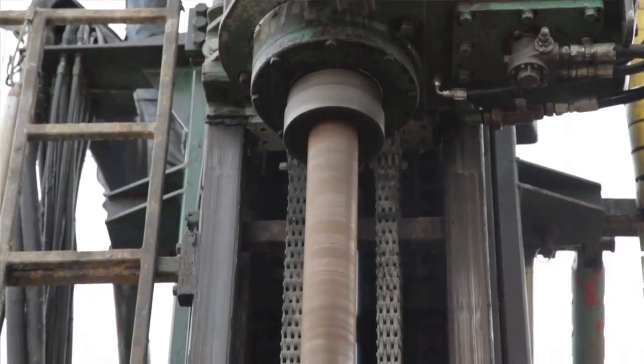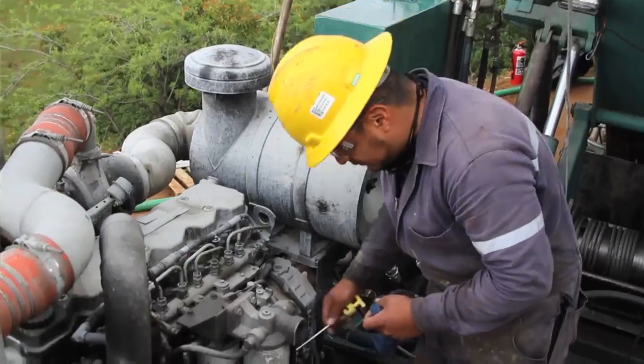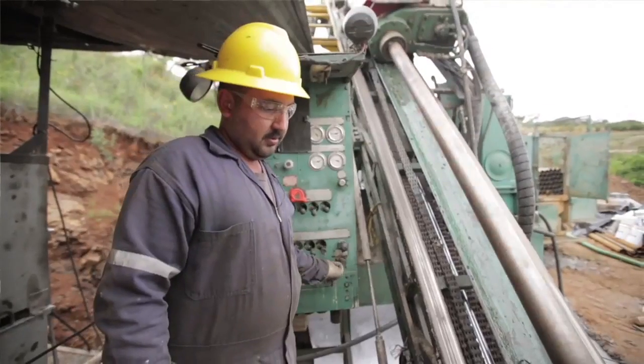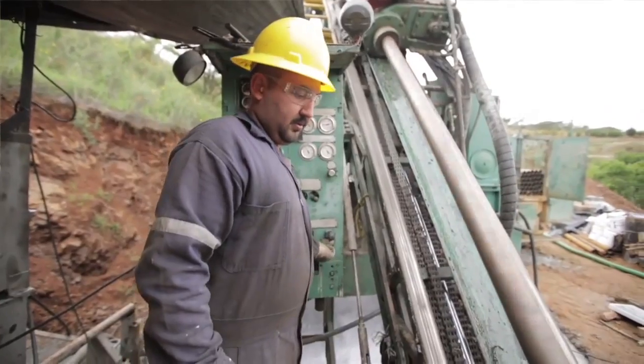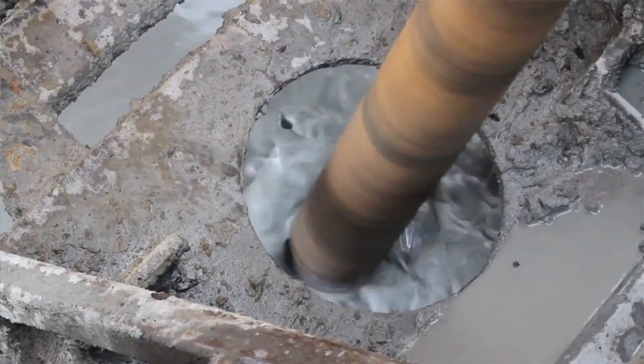They'll start revving it up just like a motorcycle and it'll get louder and louder. As with many mechanical components, you do have engines blowing up. Because there's a four-speed transmission just like in a car, and the driller is actually shifting up. When he's further up in the hole and he's got lots of power, he can gear up into fourth gear and run the drill quite quickly so it drills faster. As you get further down, it may not have the power to turn in fourth gear anymore. If the driller is daydreaming, all of a sudden he hears the sound because the motor is about to blow up because it's overheating.